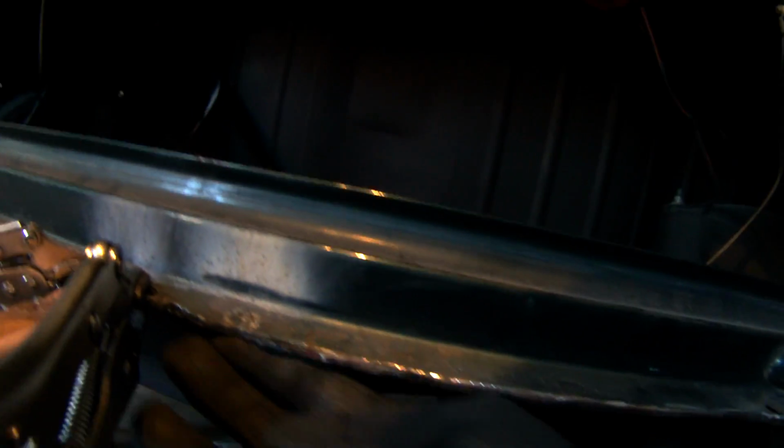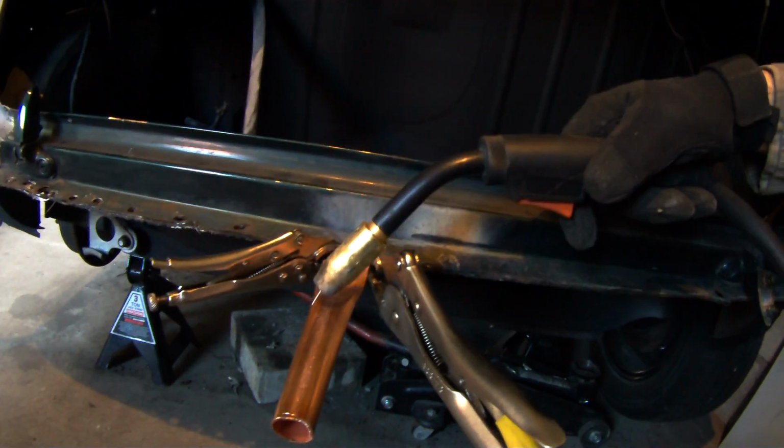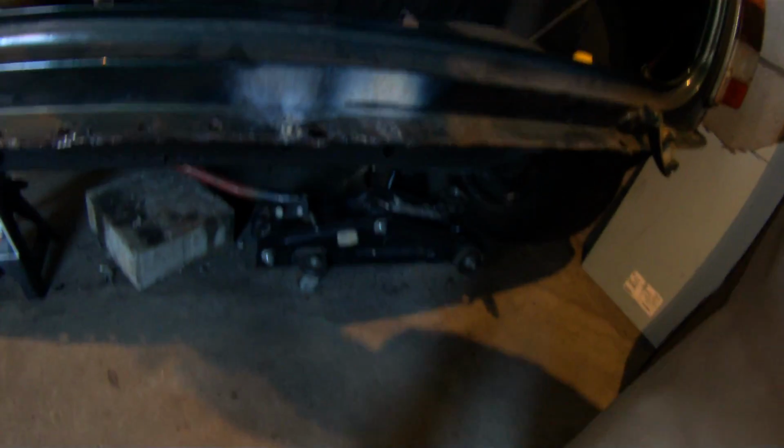But let's see underneath. I'm not going to be able to see underneath, but it's completely flat on the bottom because it's against the copper plate. It's not going to let the weld stick to the copper plate itself, but it will stick to the steel that you're trying to weld because of the material of the copper. So let me show you this real quick. So I took it off there, and as you can see, it didn't stick at all to the plate itself.